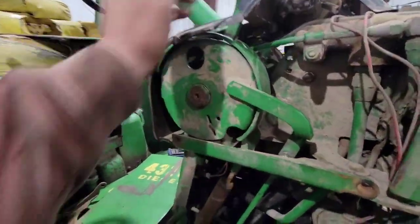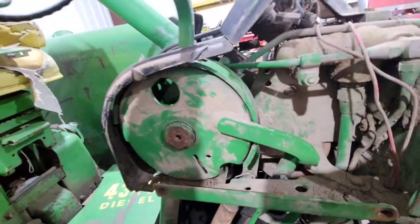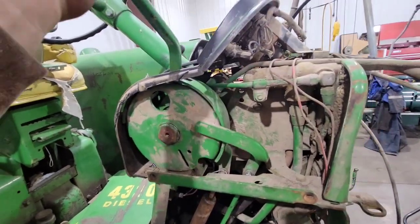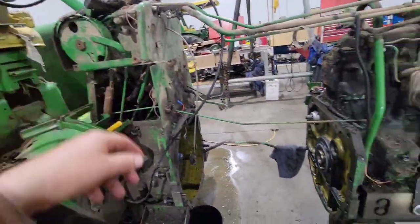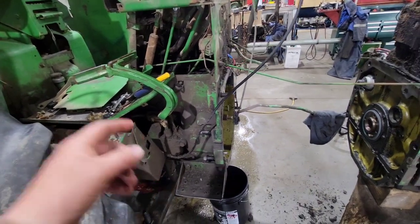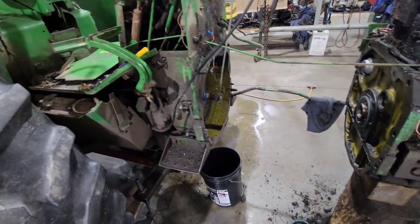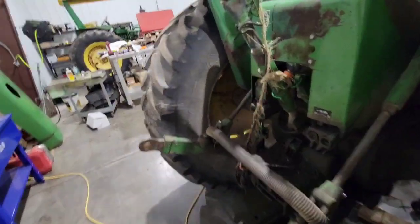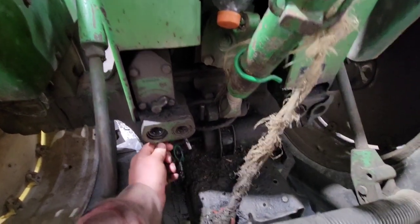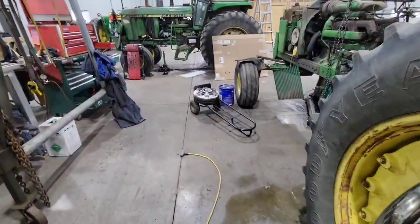Right here's your block, and that side-to-side movement is just rocking on a couple roll pins. When they break, you go to shift the lever and the whole lever flops around — that's no fun. Got that redone already. I'll do the transmission filter because we're here and it's low on transmission oil. If I'm going to refill the oil I'll do it on a clean filter — nobody ever got hurt on the side of safety. These couplers back here — the barrel kits — it's just a simple O-ring kit on these barrels. If you can move the SCV like that, it's time for a barrel kit. A couple hours and you're done.